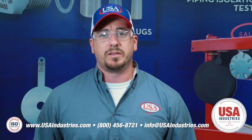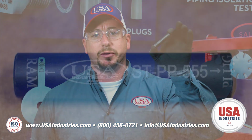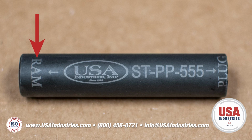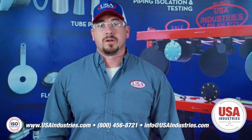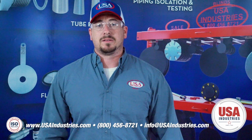In order to install the size 555 Snap-it plug, you're going to need your size 555 plug positioner. Just like we did in the near-end installation video, you want to make sure that you have the side that says ram facing the ram and the side that says plug facing the plug before installing the Snap-it plug. Your next step, we're going to get the plug ready for far-end plugging by removing the breakaway and adding the stud and coupling.